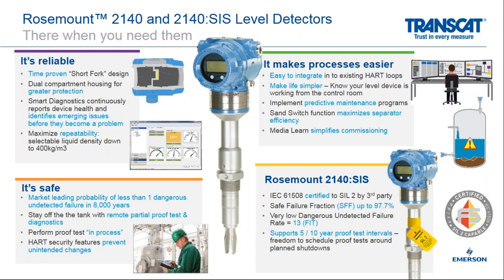Okay. Can this be used with freezing liquids? Yeah, you certainly could. Since we're monitoring the frequency, for example, if you were to take this at 1400 hertz and dip it in water, it may drop down to about 1200 hertz. And then when it freezes, you're going to get a slightly different frequency because the specific gravity is what this device is responding to. So ice has a different specific gravity than water, than oil, than foam. And we can detect all those different process conditions just based on the frequency range. So again, if we were to freeze water around the forks, you'll see a different frequency band than if you were just to dip it in water or oil.